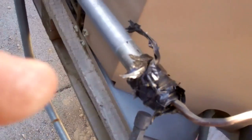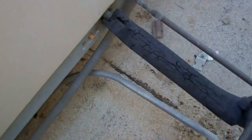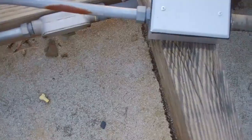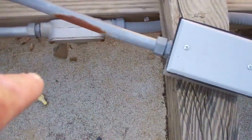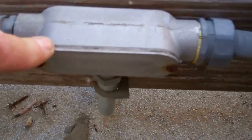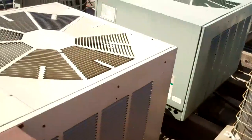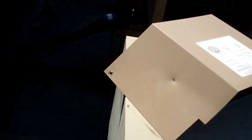So here's where the 2-wire, or 4-wire, goes — down the conduit, comes down here, goes under, goes to here, to this SLB here, goes down there, goes to that junction box. And 125 feet behind me, down to the fan coil, which is wired for 208.